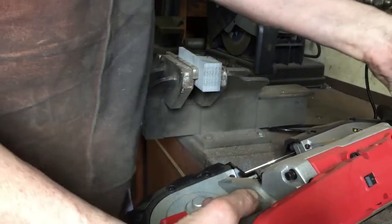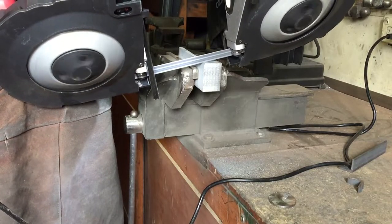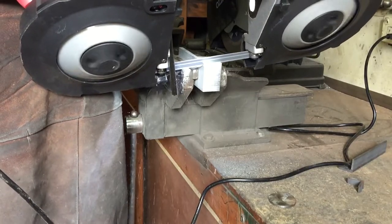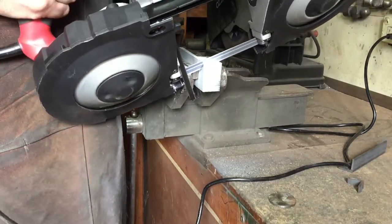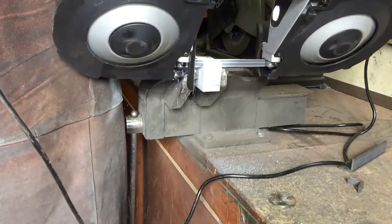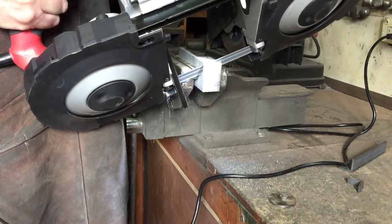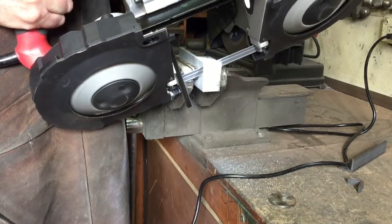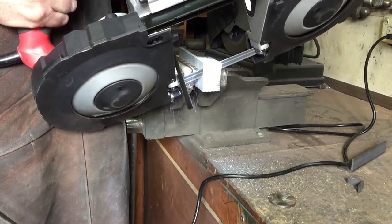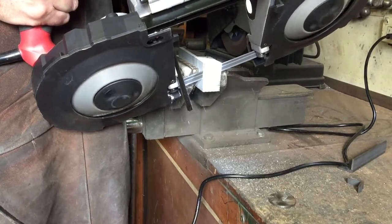Anyway, the last cut is a chunk of aluminium that's about 35mm by 50mm, and I'm cutting at the maximum speed. It doesn't seem to cut aluminium all that much faster than ordinary steel. Anyway, I'll be probably only cutting aluminium on my normal wood cutting bandsaw anyway, because that does a really good job of cutting aluminium, and I'll be only using the portable bandsaw for steel.